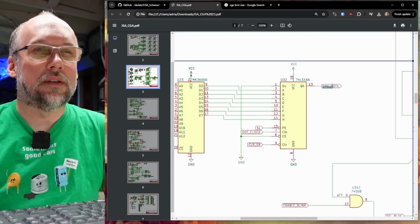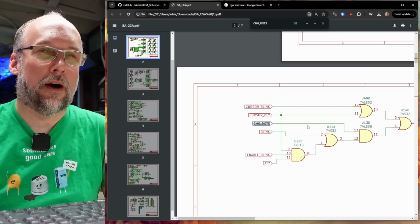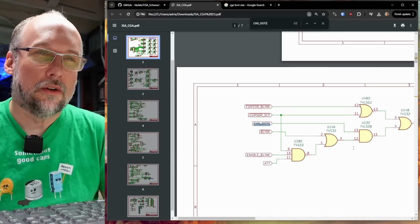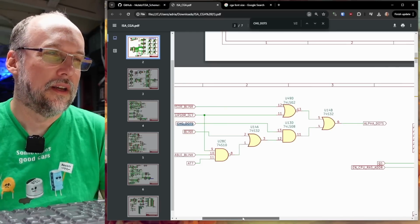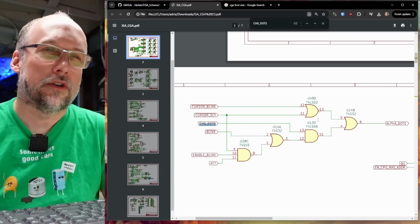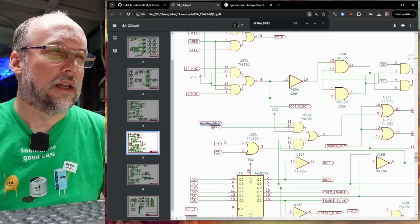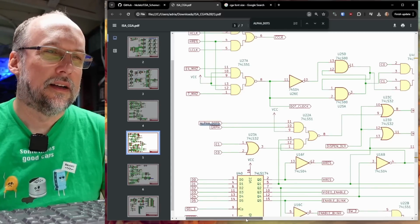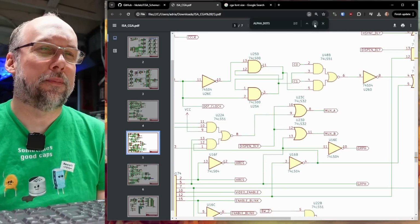Now let's find out where this character dot signal goes on here. Here's one spot it goes. The nice thing about this schematic is it's searchable. This goes into that gate there, and it outputs alpha dots. And there's various things that also go into these gates, like blink and cursor stuff. And let's look for alpha dots here. Looks like alpha dots comes in here, goes through some more gates. And let's see where this comes out. Mux comes out of mux output.